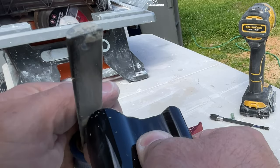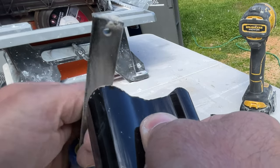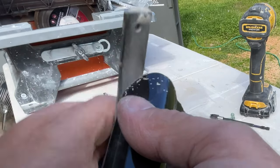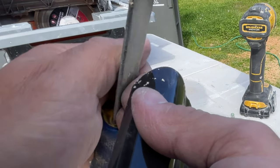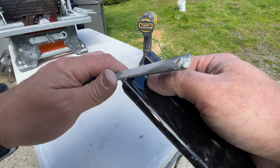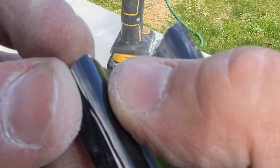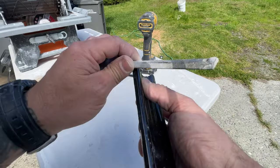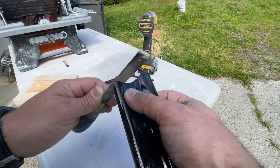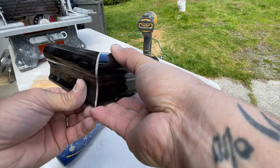Here I am honing the tile down. The best way is to drag it like this — if you try to saw back and forth, you'll actually end up chipping the ceramic coating, so you don't want to do that. It's a nice drag over the edge, away from the coating. And there you have it — a nice clean edge.